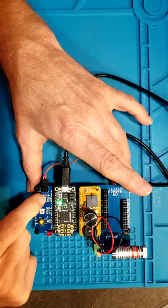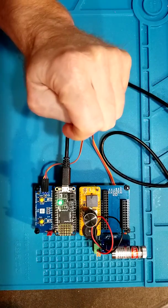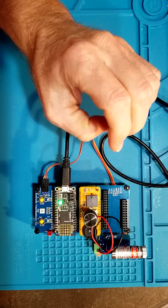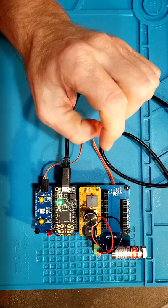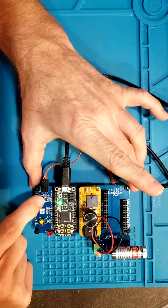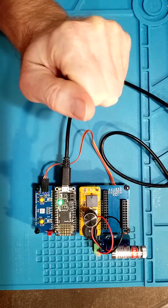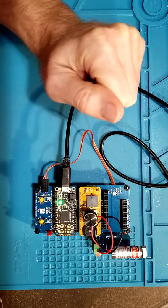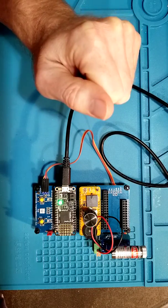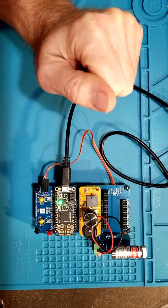So just like every other test, SW0 to continue. So the next demo test part is press SW0 again to start printing the temperature, then again to continue, of course. If you press SW0, it takes a couple samples and then it prints out both in plottable form, that single tuple on the line, and then on a line that isn't formatted as a tuple, it actually tells you what the degrees Celsius is.